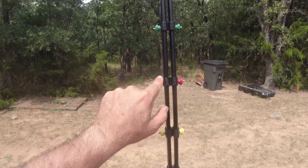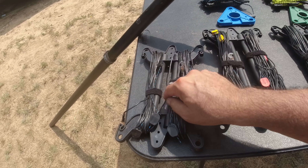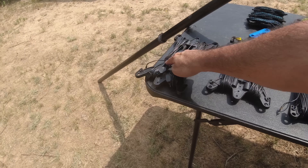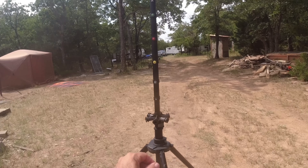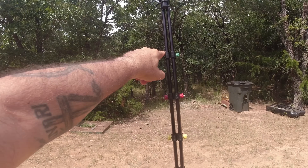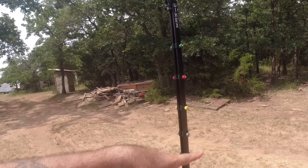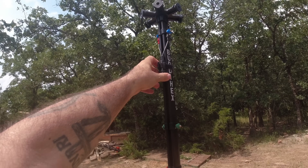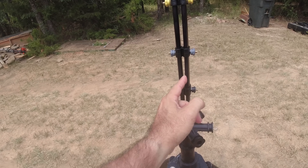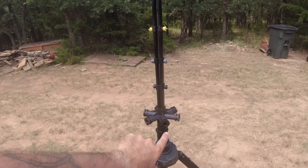The bands are 20 meters at the top, then 17, 15, 12, 10, and 6. The great thing about the Buddy Hex is the color coding: black and gray, red and yellow, green and blue — each color matches the separators and wires for each band, so 20 meter is black and gray. For field day, the yellow and green ones — 17 meters — are not allowed, so I'm skipping those today. You can put any combination on; it's all fed from the same feed point. These separators were added later and provide stability to the center mast.